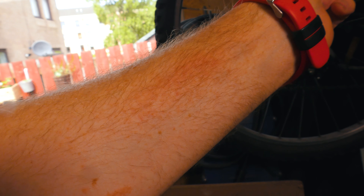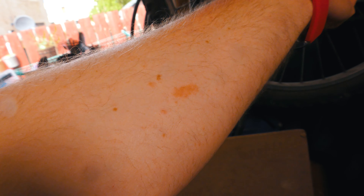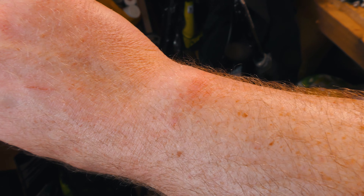I've definitely learned that water on the part when you're sanding is very important because the dust just gets everywhere. This epoxy is no joke. As I've gone on I've started using more and more safety gear. See this patch on my arm where it's red? That was a tiny little dot and then I rubbed it all off. This was another piece of epoxy which got on my skin and I didn't notice, so it soaked in longer. I've still got my splinters. There's another patch on my wrist here. Seriously, this stuff is no joke. I've joined a Facebook group called 'Epoxy is Not Your Friend' and it's full of people making fruit bowls who've all got rashes and big blistered eyes. So yes — epoxy is no joke.